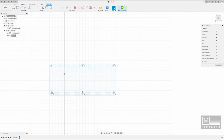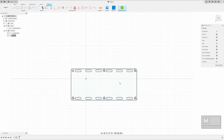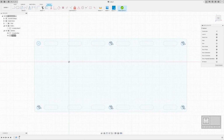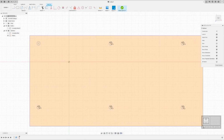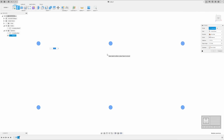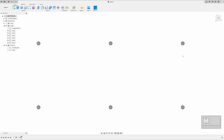And now we've got 6 different risers here mapped out in the locations where I want them. I'm going to select them all, right click on it and hit extrude. And we know that we want approximately 4 inches, maybe 3.5 inches, 4 inches. Let's just say 4 inches. We can always trim them down later. So we're going to hit 4 inches on those and hit OK.